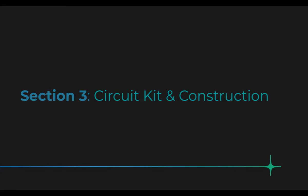Okay, everyone, measure the voltages on the batteries. If you want more practice, you can go on to the 5-volt bus or 5-volt line over here, put the positive and negative onto that line, and then turn it on. And then you should be able to read 5 volts.